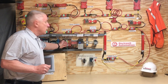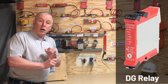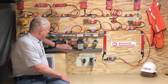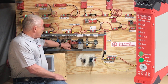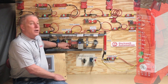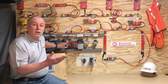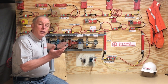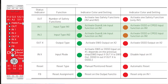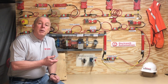We start with the brains of the operation: the DG relay. D for dual — two inputs — and G for GuardLink. The DG is a configurable safety relay, configured with the two push buttons on the front panel. If I press it once, it tells me the current configuration. The power LED is green because power is on. The OutX LED is green, indicating I'm using both input 1 and input 2 — if I was only using input 1, it would be red. Inputs 1 and 2 are both green because they're set for GuardLink; if I wanted OSSD, it would be a red element.